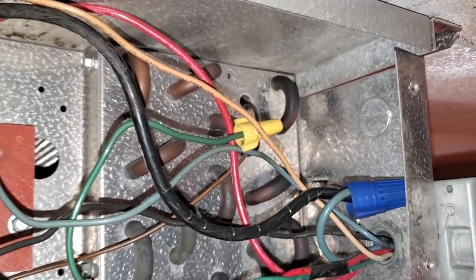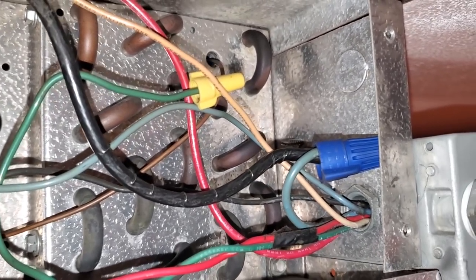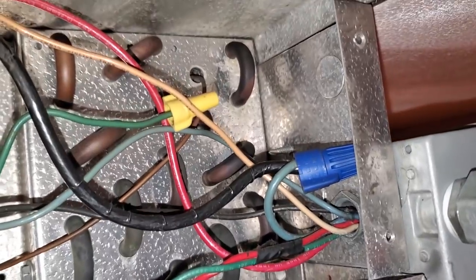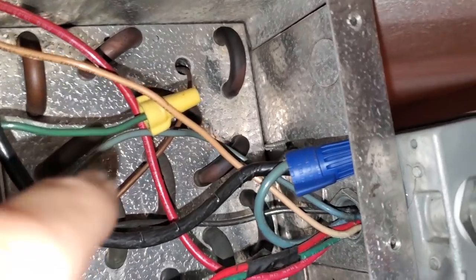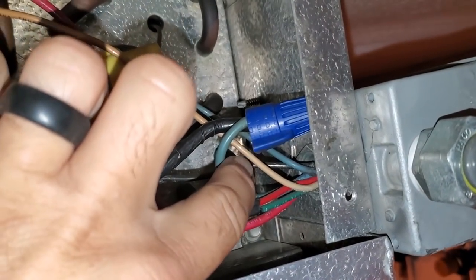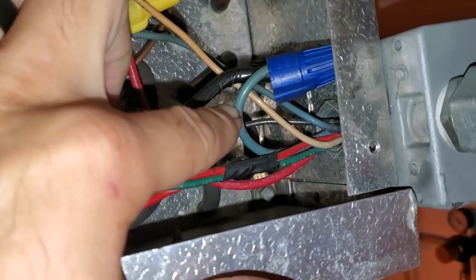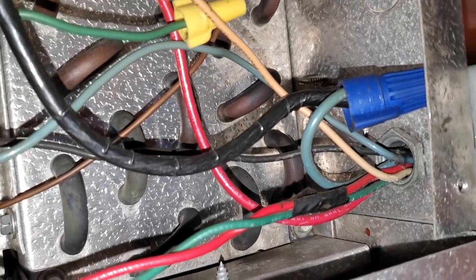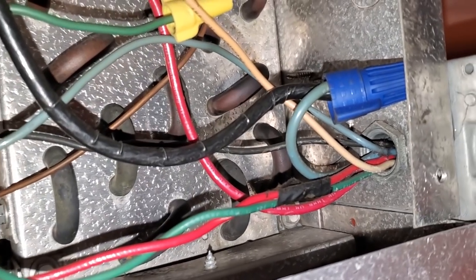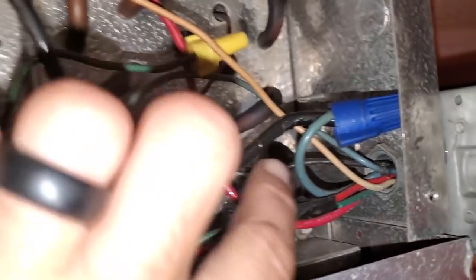So this thing's a mess. I'm trying to rationalize what they're doing here and make sense of it. But look at this — this is a heater wire and they're going from like six down to a 12, and that 12 is rigid because obviously it's running super high amps through that 12 gauge. I think those heaters were pulling almost 20 amps. That might not even be a 12 — I bet that's a 14 because it's got a thick jacket on it.